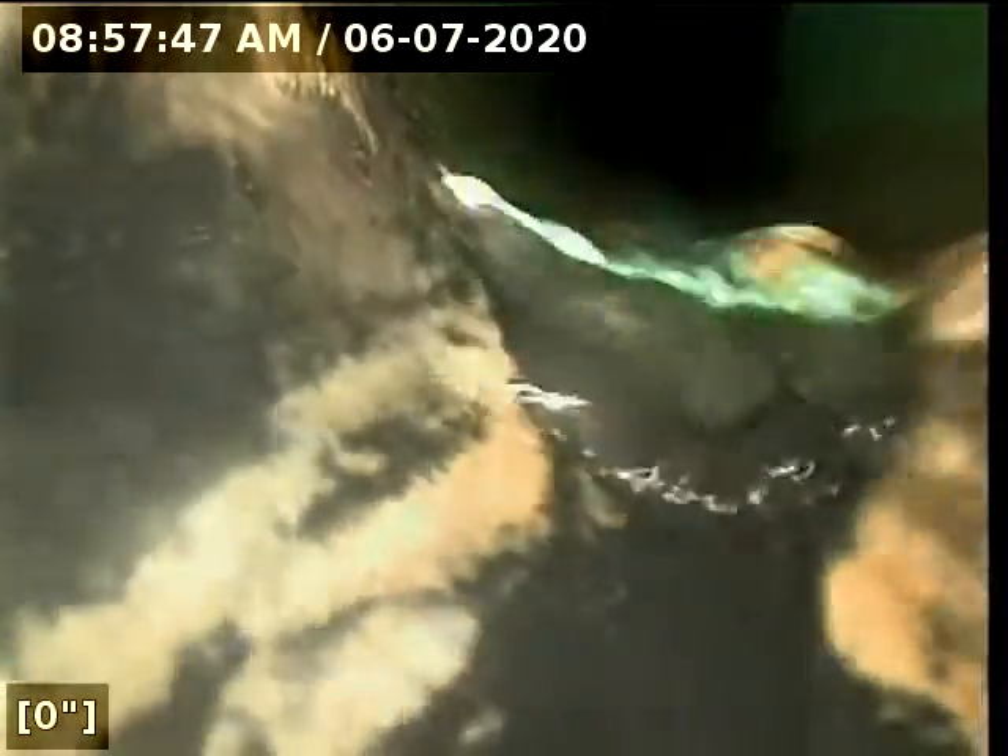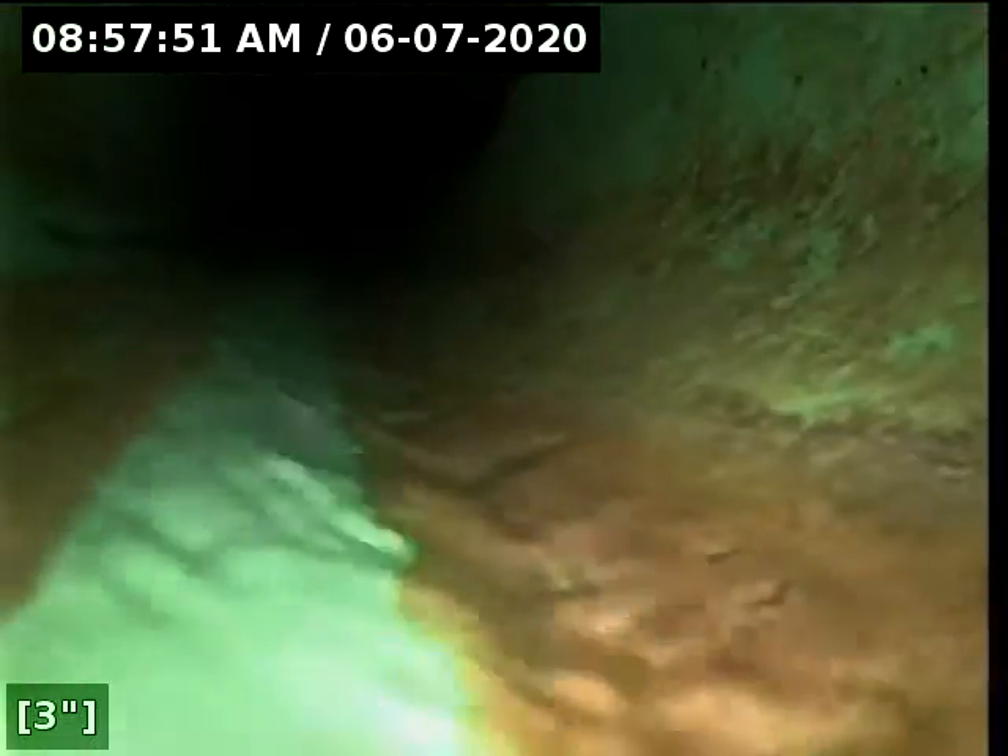The house is facing south — there's the south street and your front entry. Here on the ground on the southeast corner of the house is a three-inch ABS clean-out; this is where I'll be accessing the line for inspection. The purpose of this inspection is to determine the overall condition and serviceability of the sewer lateral for this property to the city main. Immediately we transition from ABS to 3034 pipe.